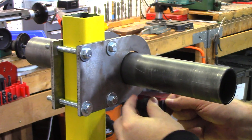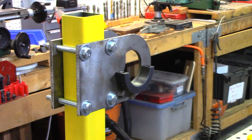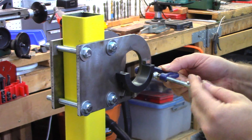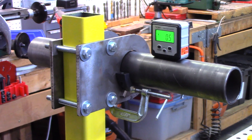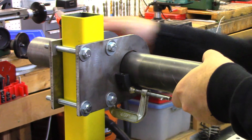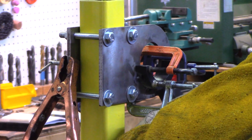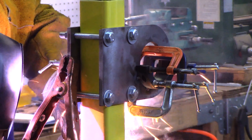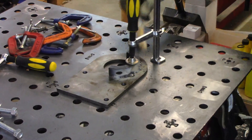My design has a very large diameter rear spindle for reasons you'll see later. It'll be held in place on this rear fixture with two large shaft collars. I placed the spindle in the plates and temporarily jigged up the bottom halves of the split shaft collars, lightly clamping them in place with C-clamps. I then tapped the spindle until it was perfectly horizontal while resting on the bottom halves of those shaft collars, and then tightened the clamps. I then removed the spindle and added more clamps so I could tack weld them into place. This is by no means a final alignment of the spindle clamp, but merely ensures it's not going to be grossly misaligned — the final alignment would take place on the table utilizing the small amount of adjustability of the plates on the vertical post.